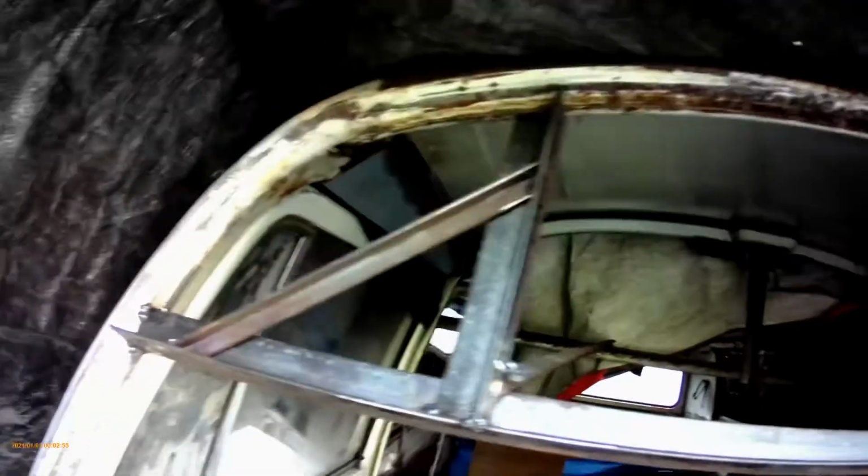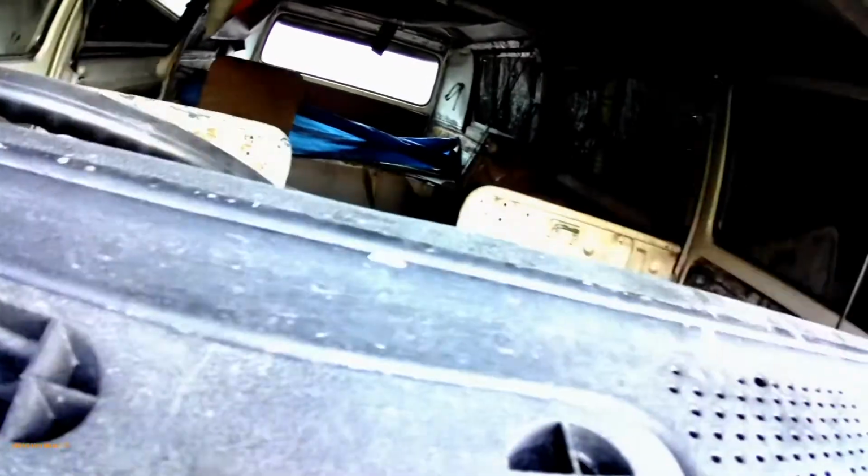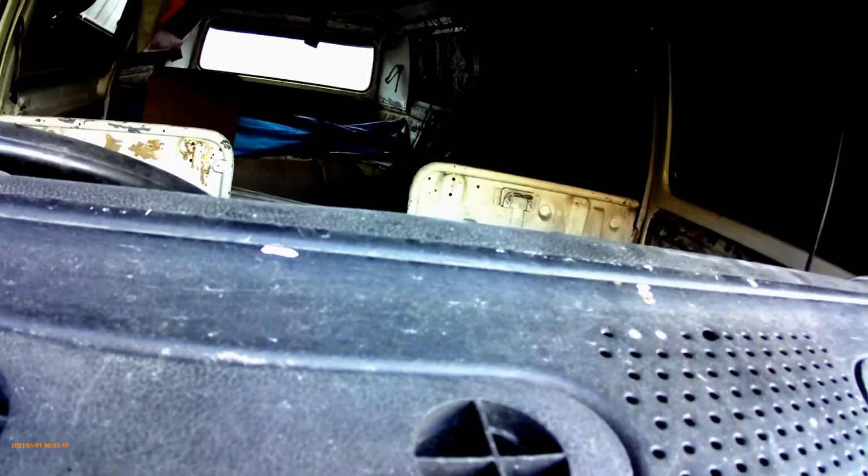Inside, if you can see, it's all braced. That's all ready to go. I've got little brackets in that, so that the roof catches and sits on that. There's a little bit of deflection in that, which is cool, because if I need to, I can wedge it. I'll have the measure all the way along, so I've got enough deflection in that if I need to pack it up. And the same with the back.